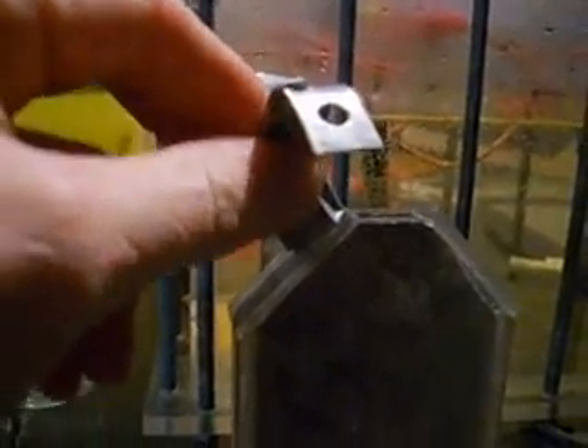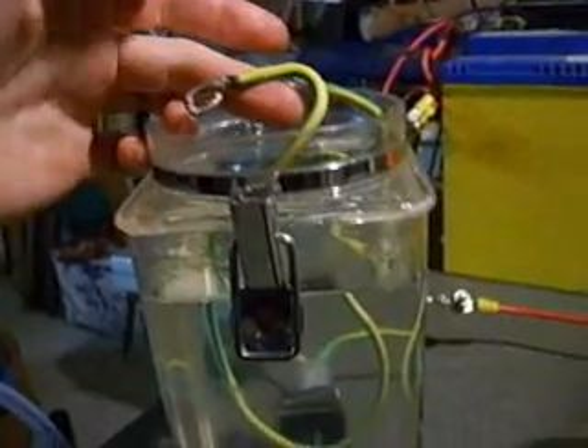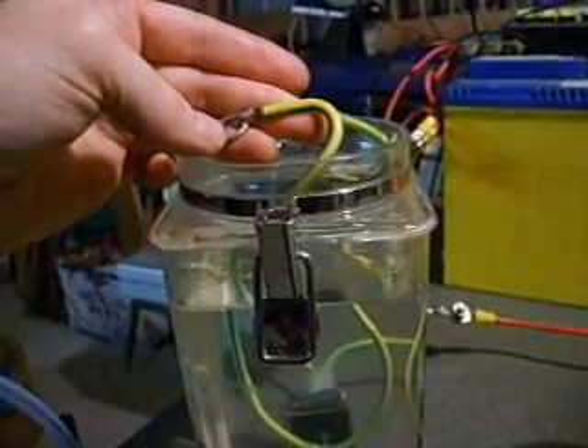The new design I'm going to work on will involve no glue at all — it'll basically all be screwed together with stainless steel screws. Up here these terminals are currently just wrapped in tape; that will eventually be completely sealed with something like heat shrink. The idea of running these straps right up to the top of the water and then having the bolt system on — I'm not particularly keen on that, mainly because stainless steel isn't the best at transferring current. I'll probably end up using some cables similar to these, with lead-free solder, sealed up, all covered with heat shrink — just to get the bulk of the power as close to the cell as possible.